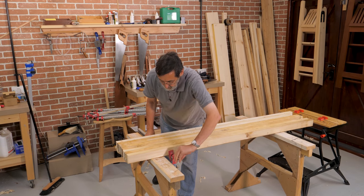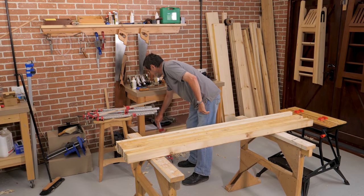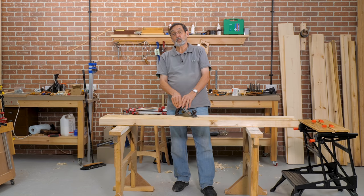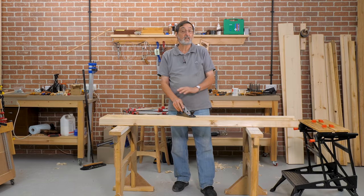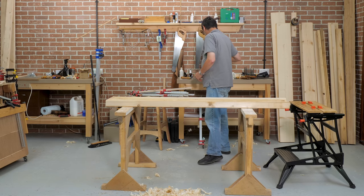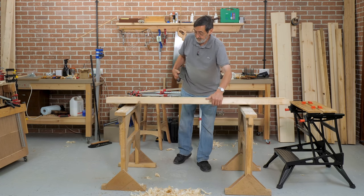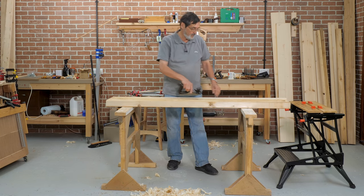The other thing is, which plane do you use? Which plane would be best suited? I have a number four, and I would use a number four without any problem, but I'm also in possession of a plane that I use as a scrub plane. It's just a converted number four plane, and that's what I'm going to use to start with, because I can take off a lot of material with this. I'm not sure which is my underside and which is my top side just yet.